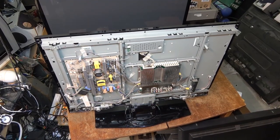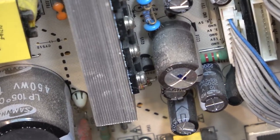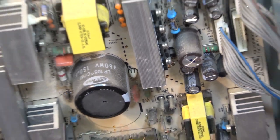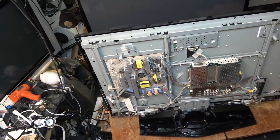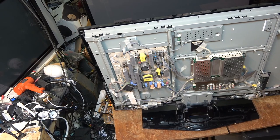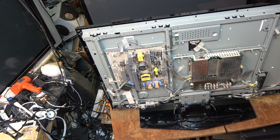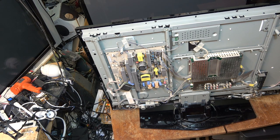I got the back off this TV and I already see what the problem is. Do you see what the problem is? Puff the magic capacitor has popped its top. I bet that's all that's wrong with this one — it's not powering up the backlights. It appears the backlights aren't lighting up, and when you turn it on a couple of times, that cap builds up a charge. So let's pop the power supply and see if I can fix this in record time.